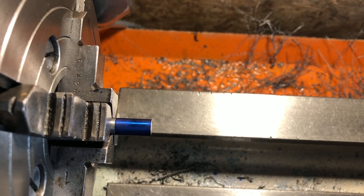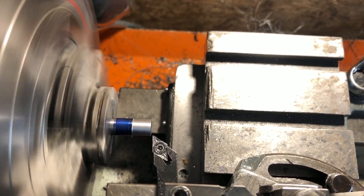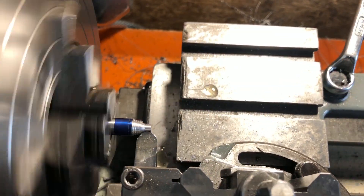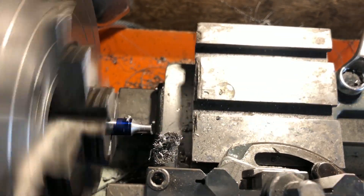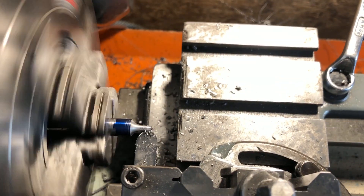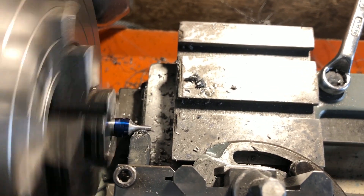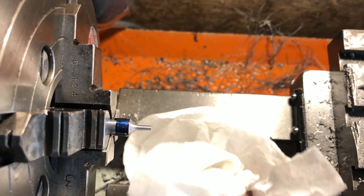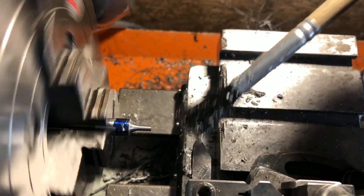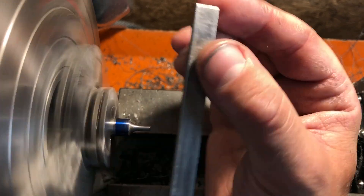I have again dialled this into the four-jaw, and I'm marking out the dimension with the odd leg calipers. This side does have a radius, so as usual I'm removing the bulk of the material using a carbide tool, and then switching out to a form tool to cut the radius and take to final dimension. I'm taking this down to a few thou oversize, and then switching to my test piece to take the final couple of passes. Well it's taken a while, but I now have a good fit. The pin fits into the hole smoothly, and I can't feel any play by hand. Adding a slight break edge, and finally rounding over the tip using some wet and dry with a steel backer, eventually finishes this part.